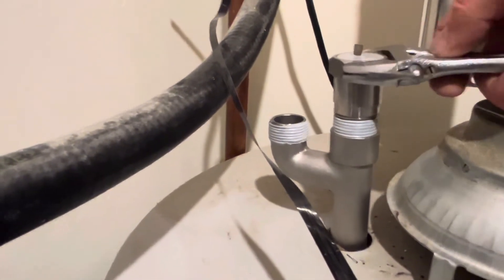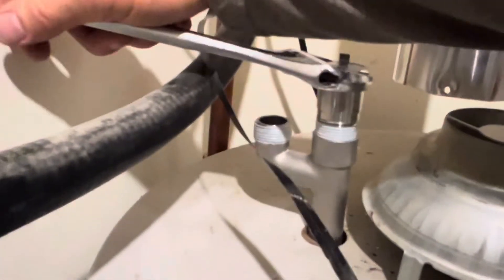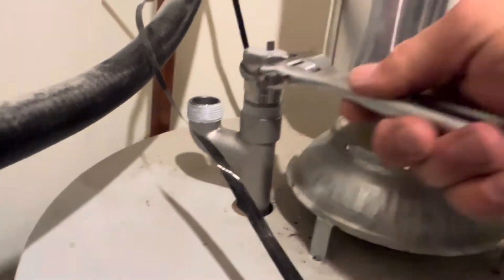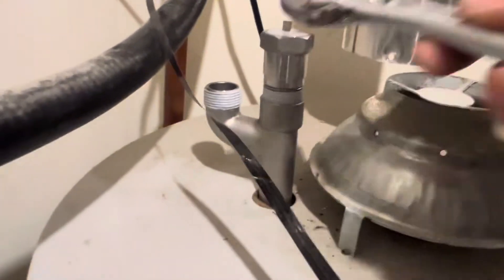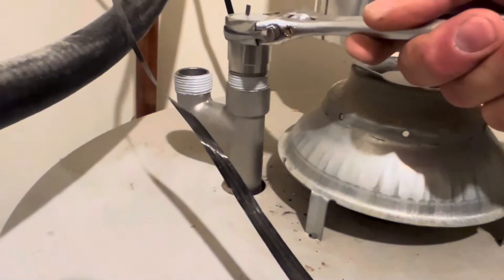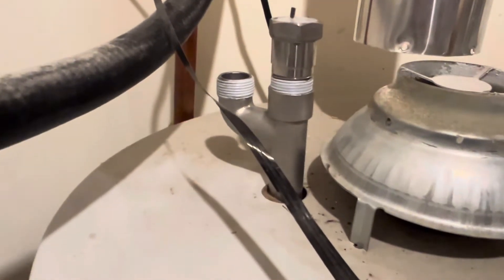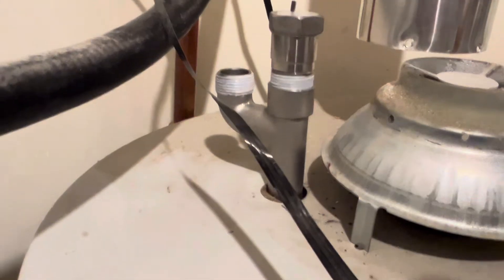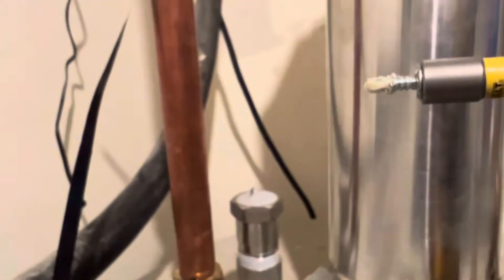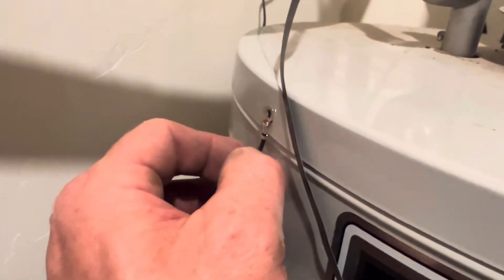This does not have to be 900 foot-pounds of torque — despite my tendency to over-torque everything, it doesn't need to be ridiculously tight. I'm using both hands here to keep it from spinning and tighten it down just a little bit more. For the last part of the installation: you've got the power outlet here and a ground wire that you attach to one of the screws on the tank, then attach the positive lead to the powered anode and you're done.